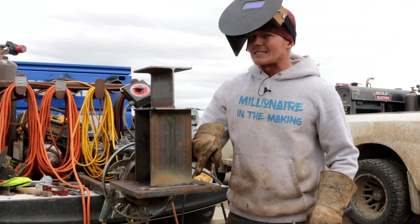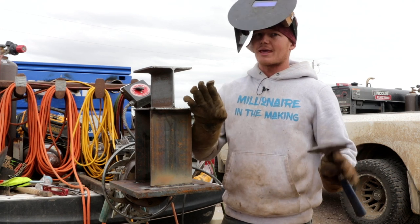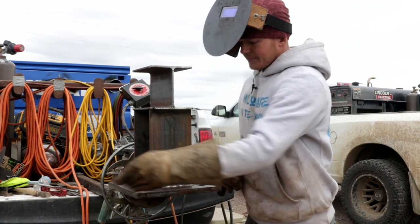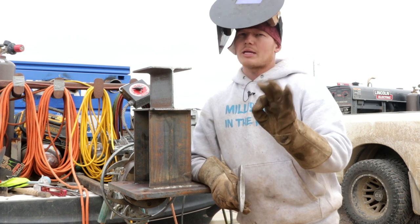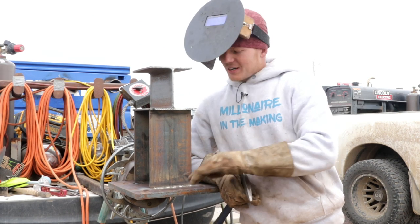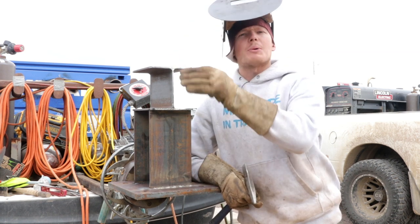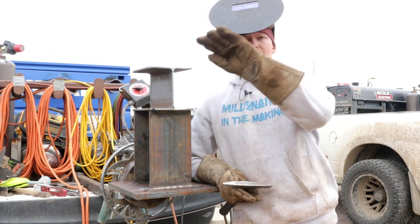Make sure when you're chipping these things off, you keep your eyes protected — this stuff likes to go straight for the eyes. Now, one thing you're going to notice after this is all said and done, you're going to want to run a buffer across and make it look really nice before the boss walks up and sees it. When you make this pass with a root underneath, you're going to notice it kind of bubbles a little bit more. When we do it without the root, you'll notice it's a little flatter.